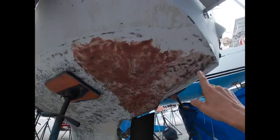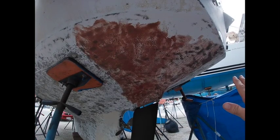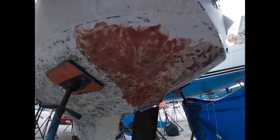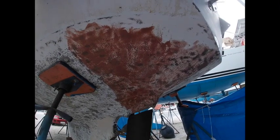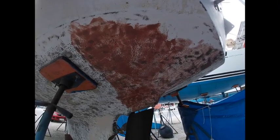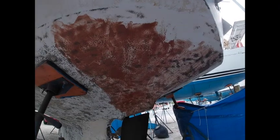And I just put some fairing compound on this back part here, and I'm pretty pleased with it. I wiped it all down real good with the denatured alcohol, and I'm feeling pretty good about that. That's three squirts in it. I think it only took me maybe 20 or 30 minutes, and it started to kick, so it was time to stop. And I'm hoping it's going to sand pretty easy,